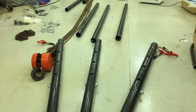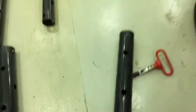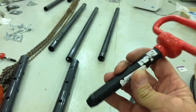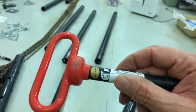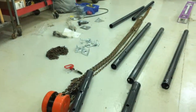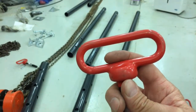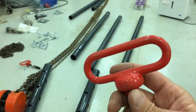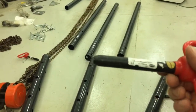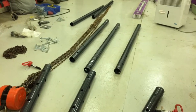I can work and adjust the pins. I'm going to be using hitch pins from the hardware store or farm store. This is a 5/8ths hitch pin, grade 5 — a stronger pin. It has a welded handle rather than a cinched one that would be prone to break. I can run my chain through here to prevent the legs from splaying apart, and it's just easier to grip and handle. The tapered end provides for easier assembly and insertion.